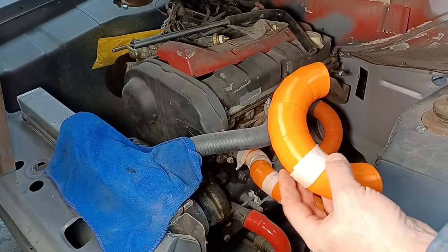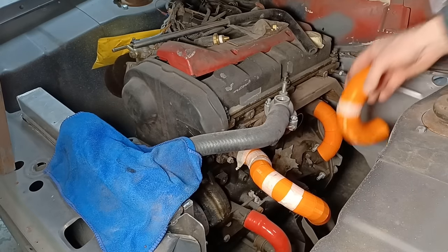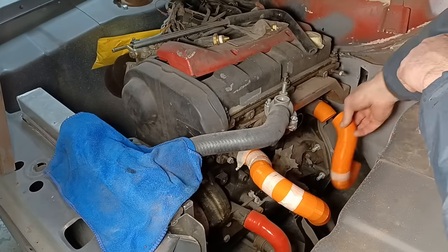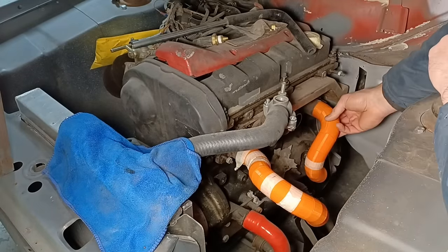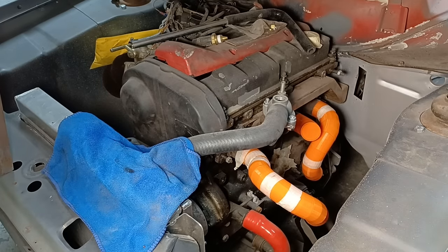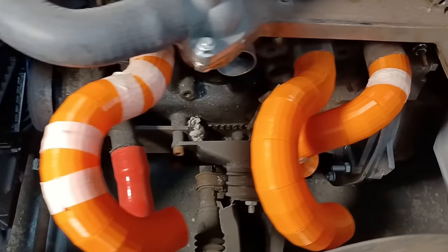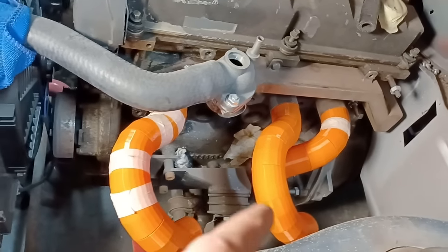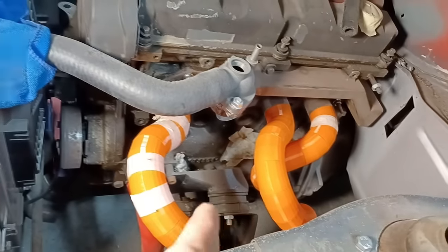That'll be a full 180 — look, it follows that quite nicely. The question now is whether we can get that in there — yes, lovely. So we've got the idea; you can start making a proper bunch of bananas exhaust by fiddling around with the configuration to get the primary lengths there or thereabouts equal. I just need to print a lot more of those off.